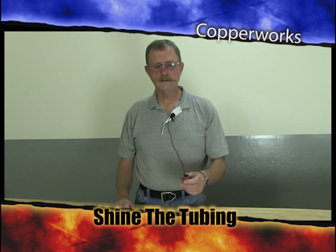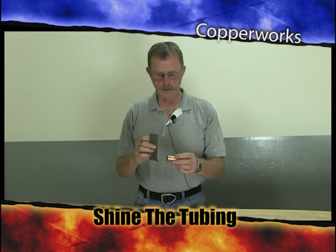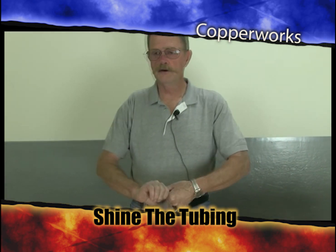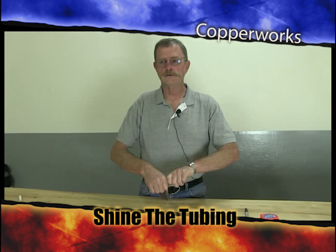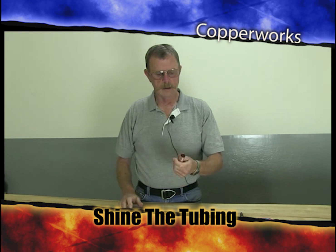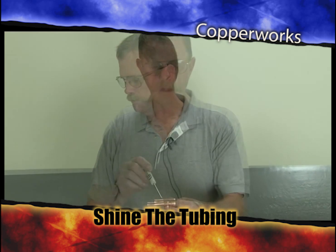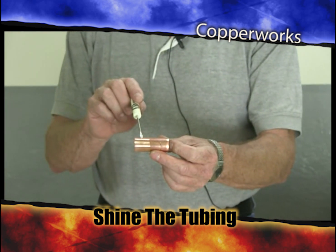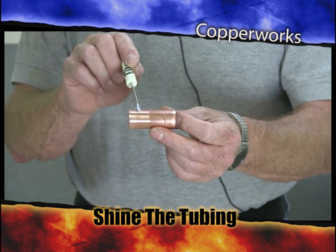The last thing you do to prepare your piece of copper is take a piece of sand cloth you have in the lab there or at the job site, and you polish this thing up. That's pretty easy. What you're doing here in this polishing is you're cleaning the copper off to accept a fitting, which you're then going to braze or solder. Notice nice, clean, shined up copper. Notice the difference here. This is what you call oxidized copper. This is what you call nice, shiny, clean copper, ready to take your brazing or soldering material. Got to clean the pipe.